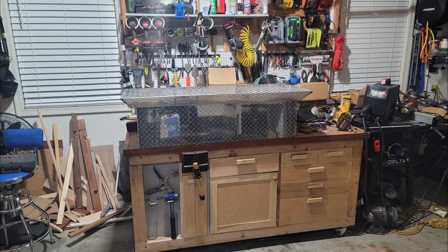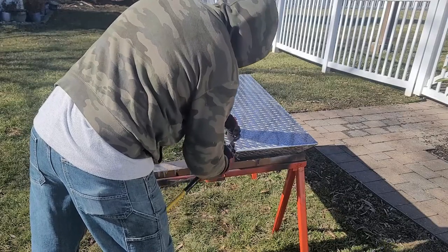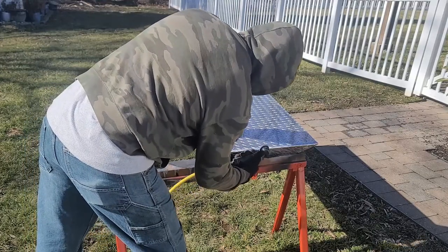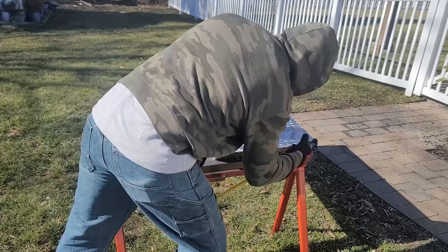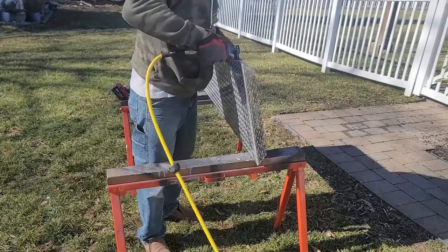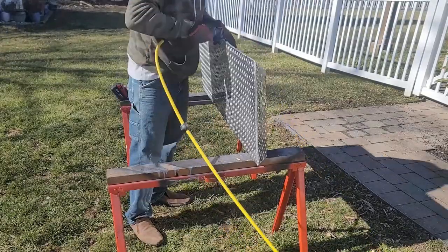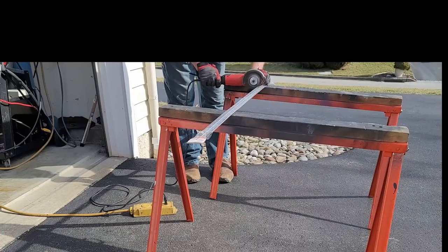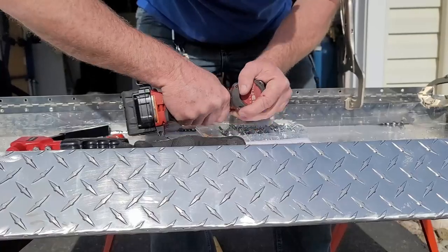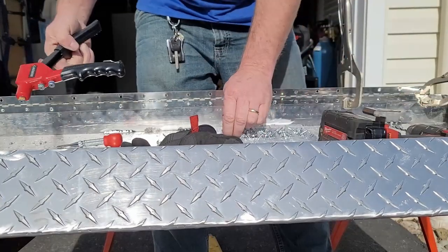Now here's the lid sitting on the box for the first time. After welding all the seams on the lid, I used a two-inch disc sander and made everything nice and smooth, smoothing out my welds. Since I'm painting the whole utility box satin black, I wanted my welds to be smoothed out rather than visible. After sanding, the next thing was to cut down the piano hinge and install it on the back of the lid. I clamped the piano hinge to the back of the lid, drilled all my holes, then used aluminum rivets and riveted every single one.